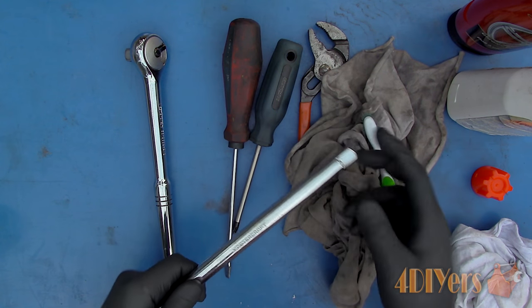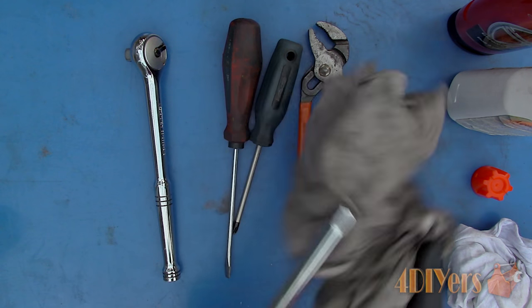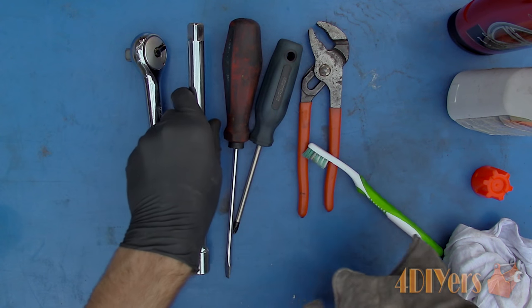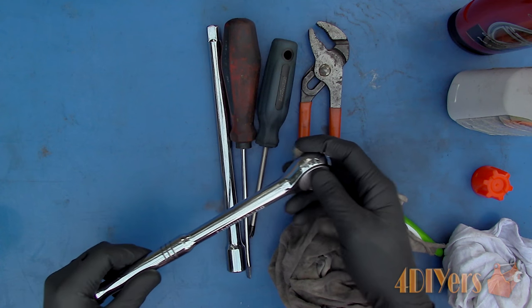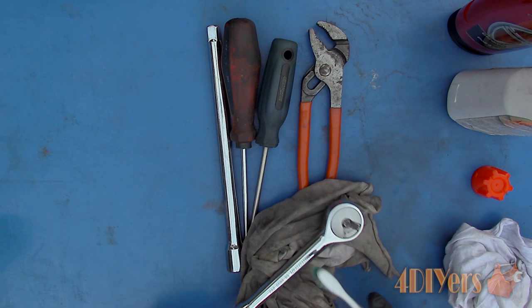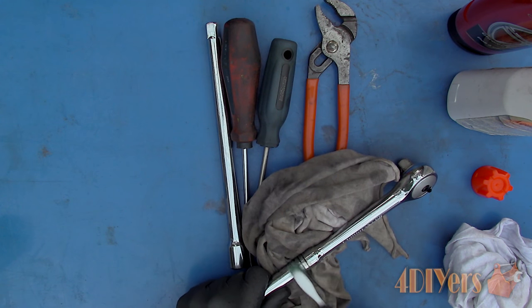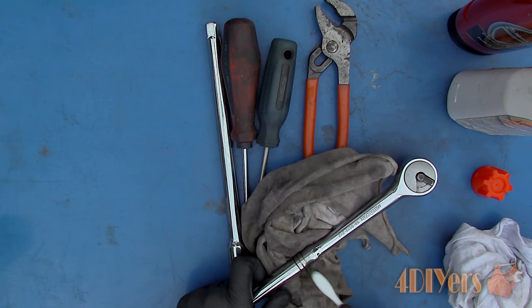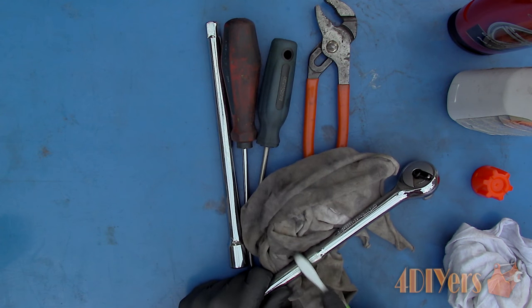For minor rusted tools, I would recommend using Neverdull for removing those stains and light crusting. Tear off a small portion of the wadding and then work it into the surface. Unfortunately, you will not completely remove the rust as a layer of protection — which can be chrome or some other form of plating — has already been damaged. You can lessen it visually though. I don't recommend using a wire brush as this can damage more of the coating or plated surface. Thankfully, with this example, the ratchet and extension are free of any rust. If your tools are excessively rusted, then I would recommend using a brass wire brush instead.